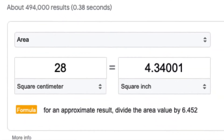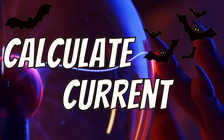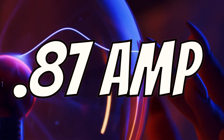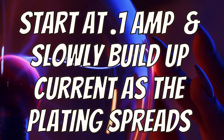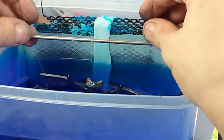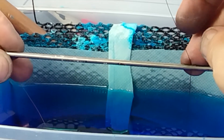If this helps you in any way, please like, subscribe, and say hi in the comments — it really helps. Based off the surface area, we will be plating at 0.87 amps, but if you start at the full calculated amount, the plating will be very crumbly and won't stick to the conductive paint. So let's start at 0.1 amps and slowly build up the current as the plating spreads. Now let's put the bat in the bath. See the cage in the back of my tank? It's an anode cage, and that will make your electroform journey so much easier.